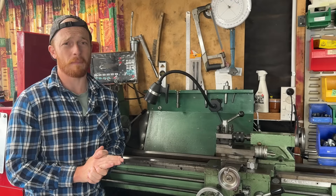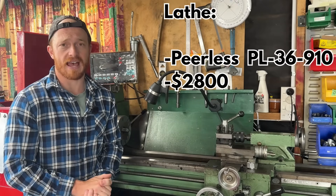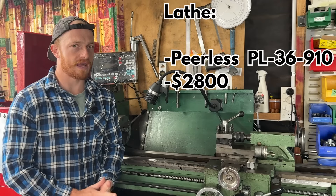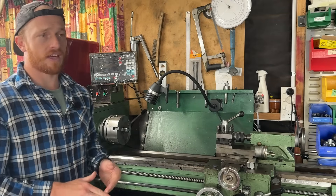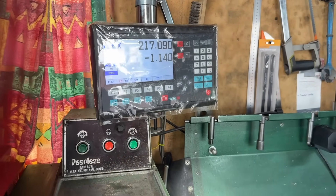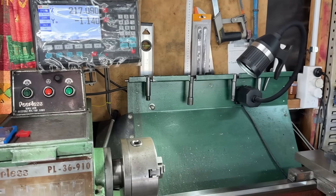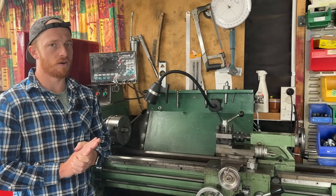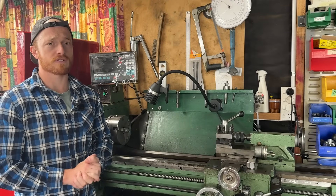The second key piece of equipment for this production run is my lathe. This is a Taiwanese-made lathe, 45 years old, and I bought it for $2,800 several years ago. It came with a digital readout and the biggest piece you can spin in here is 250 millimeters. I need this piece of equipment for making and modifying the crankshafts for the engine.